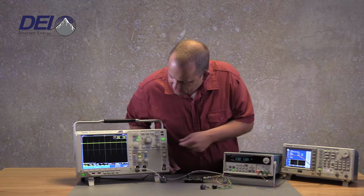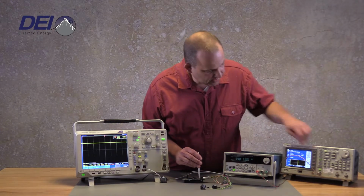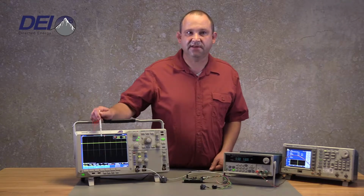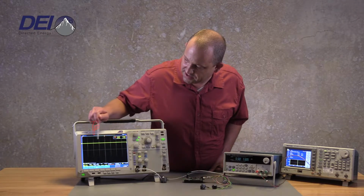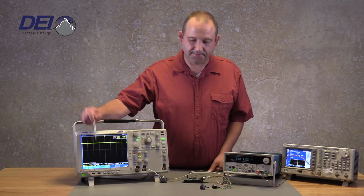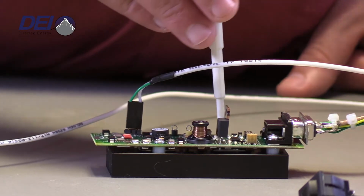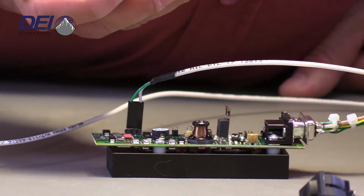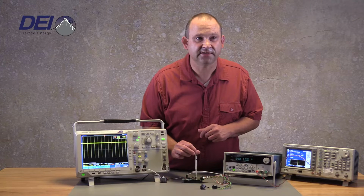which you can see right here. Turn this off. Now, as you can see on the oscilloscope, I hope you can see it at least, is the little peaks here. And this is your actual 4 nanosecond pulse width. And in order to change that frequency, we just adjust this pot, and you'll be able to see those peaks get closer and further apart. And here we are increasing the frequency, and you can see that.